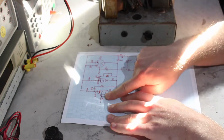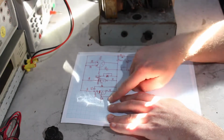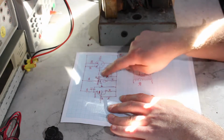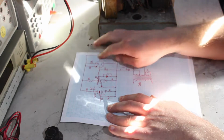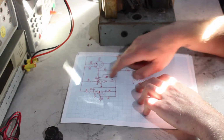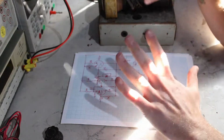So it does fit with that 12AX7 with what we've got going on here. We've got the gain control between the two halves of that. It's a dual triode, and 6U5G there, and detector there, which is a germanium diode. So I was like, well, this has got some legitimate circuit there.